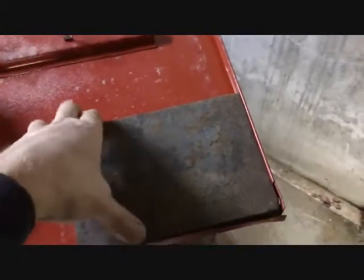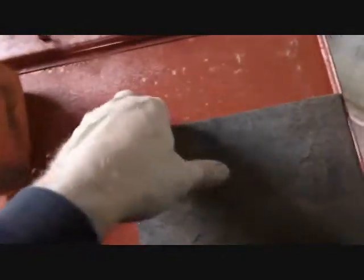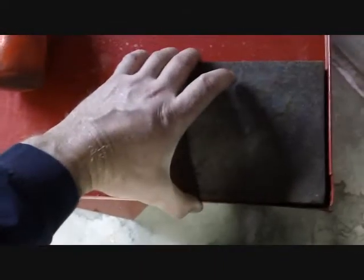Right now I want to see what I can do about straightening this bent metal. I got a better idea — get this nice thick piece of steel. This looks like three-quarter inch plate. Set that right in there, now I can see just how far out this is. I'm going to clamp this in position right here like this, then use my dead-blow mallet to tap this in.